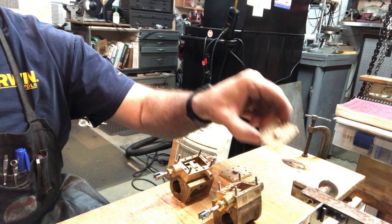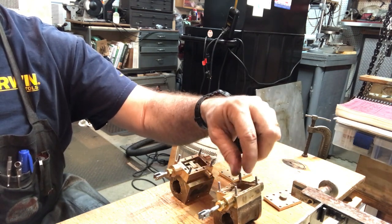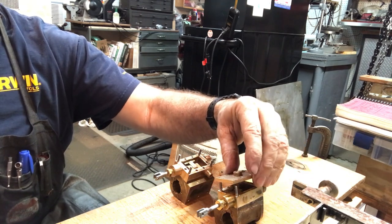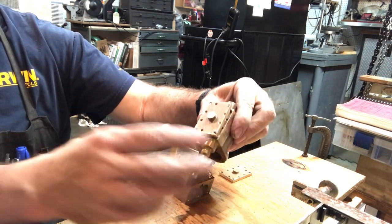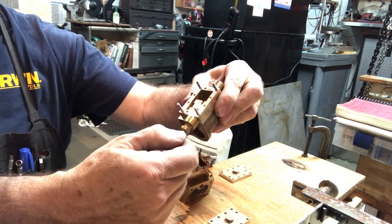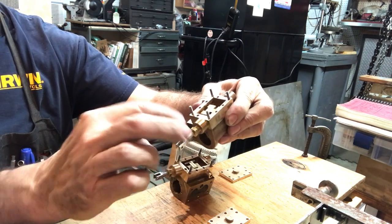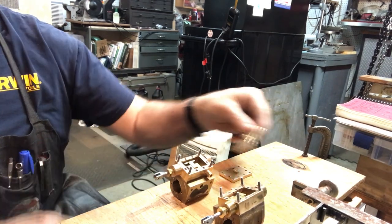Here are the valve covers. I made some little studs — little eighth-inch studs that are threaded 5-40 — that the spindle covers go over. And this will be really handy for actually setting the timing of the locomotive, because you can see as we move it through, we'll be able to see where and twist this to adjust where the valve is compared to the rod there. We'll go into that in further detail later.